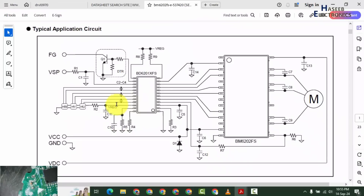The output signals from the hall sensors reach to this IC. There are three hall effect sensors for U, V, W — for three phases. These will sense the drive signal, and when it provides excitation to the stator, it will receive feedback from these hall sensors. It will then provide six signals: U high, U low, V high, V low, W high, W low.